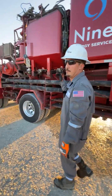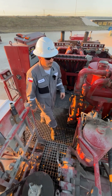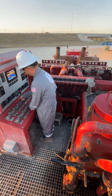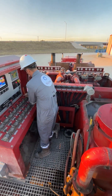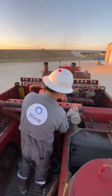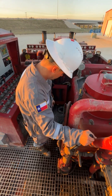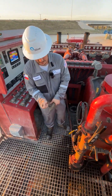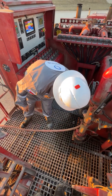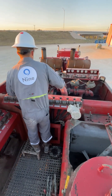Now we're ready to go upstairs and open up all of our air-actuated valves. You want to make sure your one-inches are open. Open up your outside triplex suctions, all of your interior and exterior valves, and all of your valves in your mixing system. You want to drain your red hose — I like to do this by throwing it off the side of the pump. You want to drain all the valves, your displacement tank handles, and your mud line.